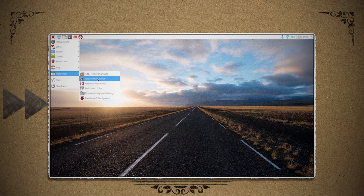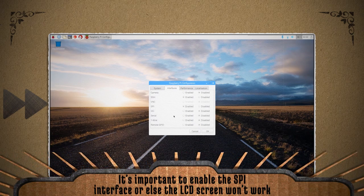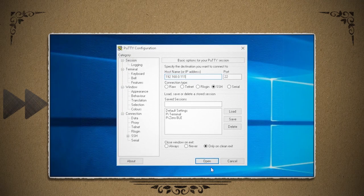Finally, click on the menu icon and go to Preferences, Raspberry Pi Configuration, and under the Interfaces tab, make sure both SSH and SPI are enabled. Then on a different computer, you can use a terminal or a program like PuTTY to connect to the Raspberry Pi via SSH.